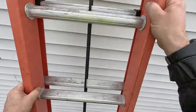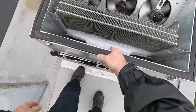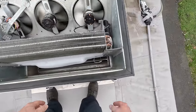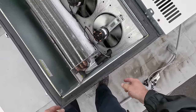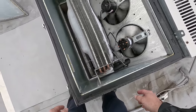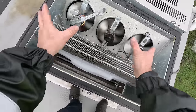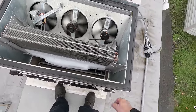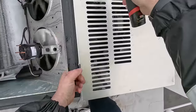It could be multiple things. I have a feeling that maybe the drain's not draining. This is just a little ice cream stand. Check this out — it's all at the bottom, which makes me think that maybe it's a drain line issue, but look how that distributor tube is. It makes me think I've got some issues with the TXV, which I've had issues where it didn't want to feed quite right. We've had issues in the past. The stupid thing shakes and it needs replaced, but that's not happening. Let's tear into it and see if we can find out what's going on.